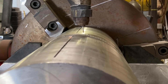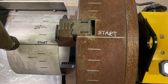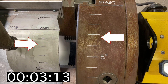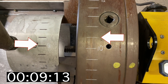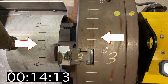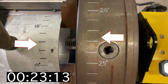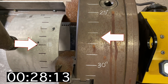So how to approach this timing technique? By marking the pipe and the chuck with one-inch increments, the SUB ARC wire and two arrows are pointing at the start line. By starting both the stopwatch and positioner in sync with one another, the stopwatch marks time in inches per minute. As both the pipe and chuck are turning, relative to their diameter differences, the chuck is traveling at a higher rate of inches per minute than the pipe, meaning the chuck covers more space in the least amount of time.